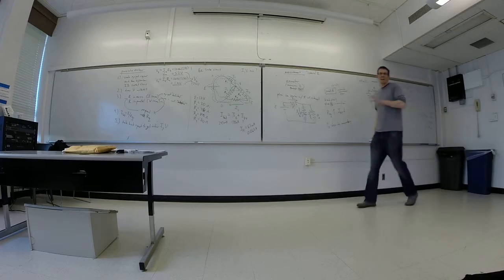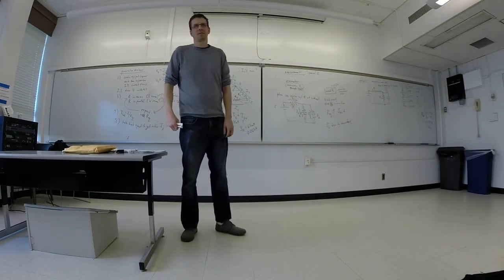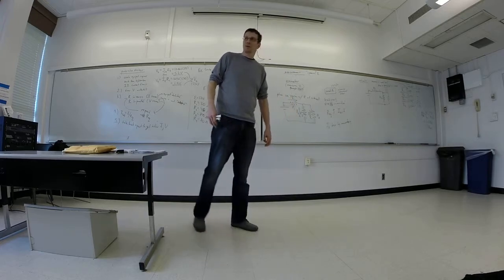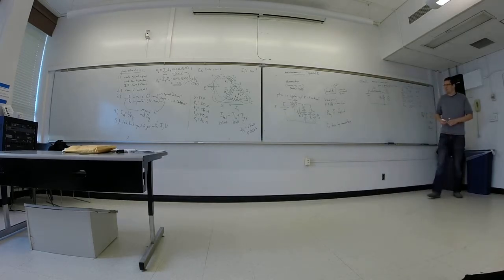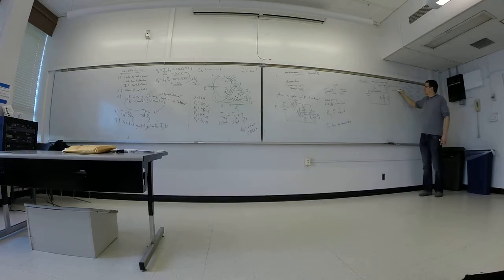Notice that this does not require breaking the circuit. You're actually adding an extra parallel branch. You're asking what's the voltage drop between B and C, which is adding an extra resistor between B and C. Okay? So that's the big thing you know when you're doing it right in lab. If you're trying to measure current, put a break in and put the thing in the main flow. This does not require a break in the path. So no break in the circuit.